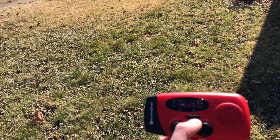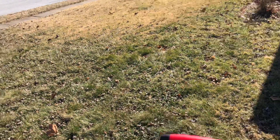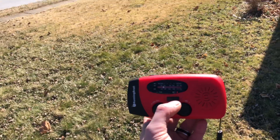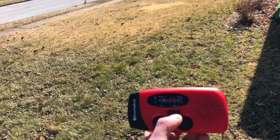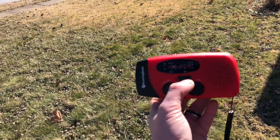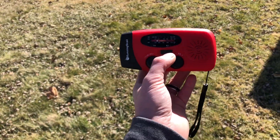So the cheap way to find RF in your house is using a little AM transistor radio and just walking around seeing what's putting something off. To negate some of that, you could use donut-size toroids — two-inch toroids — and wrap some cable around there. You can also use the clip-on toroids, whatever you need to do to get the RF down in your shack.